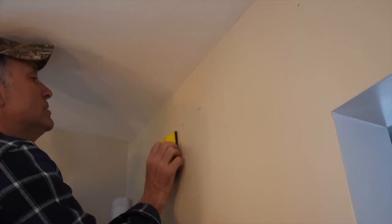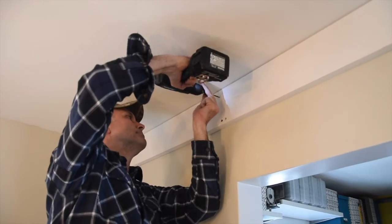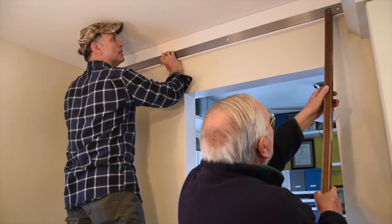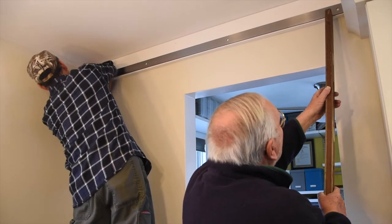The first step is to measure out and cut a mounting board if desired to add support and secure the track to the wall. Use a stud finder to mark out and attach the board using screws. Once secure, spackle those holes and let it dry. Next, lay out the track and if needed, cut to desired length. It should be twice the width of the door, and it's important the track is level before attaching it to the mounting board.